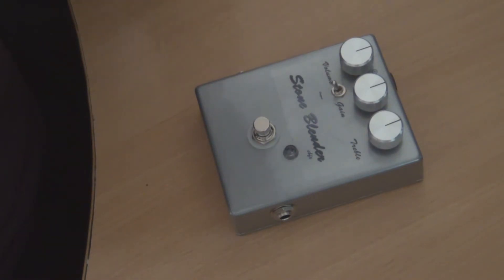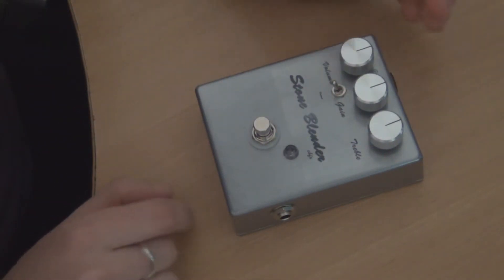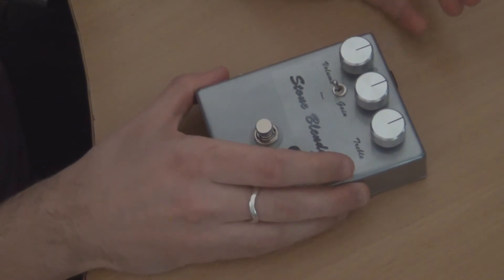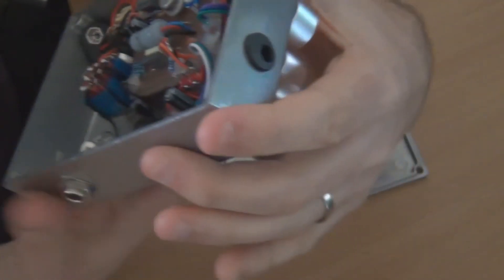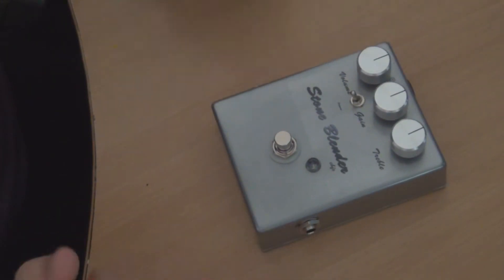So with this build I've put a switch on the front that flicks the 47k resistor on and off — just a little toggle switch. It's wired so one position has the 47k resistor on, and then you flick it and it bypasses it. I thought it might be worthwhile doing a quick video just to show you what it actually sounds like — the difference between the two — in case you're thinking about doing the modification yourself.